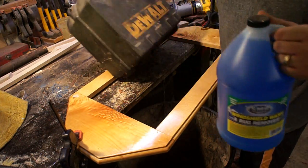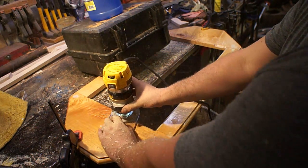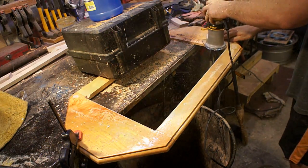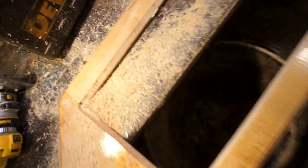How I was originally going to mount the mirror inside this frame was to route out on the back side a little place to let the mirror fit up inside, but since I wasn't going to do that anymore, I figured I would take the opportunity and put a decorative lip around the inside. The initial construction was very simple — I used biscuit joints, and then those thicker pieces on the ends were just thicker pieces of wood that I cut the angles off of and routed around everything.